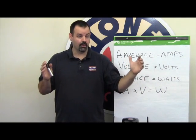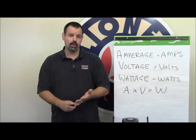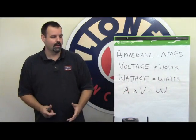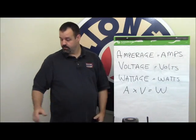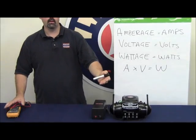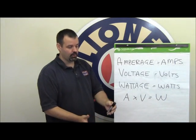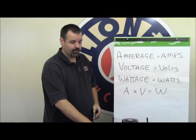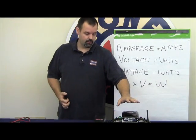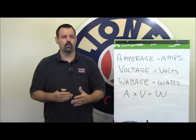For accessories, a lot of people have transformers laying around — post-war transformers or transformers from other manufacturers that are anywhere between two and five amps. If you know the output voltage using a digital voltmeter or multimeter, you can measure the terminals on the transformer to determine the maximum output voltage. You can multiply that voltage by the circuit breaker rating to determine the wattage. If you know the wattage, divide it by the voltage to find the available amperage.